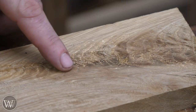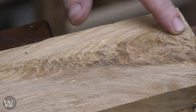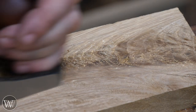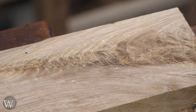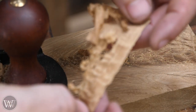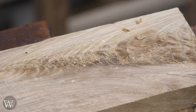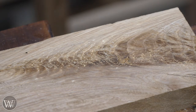You can see this grain — I've been going at it just a little bit. Nice and smooth here, nice and smooth here. I've got a lot of tear out here to remove and some tear out over here from the last plane. We can just come through here and slowly remove it, taking a very, very light shaving — these are just like half a thousandth thick. Not taking off much, basically just hitting the high spots. Slowly getting rid of all that tear out left from the last plane.